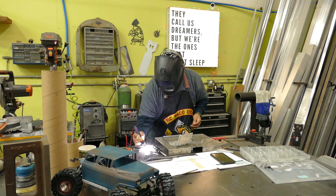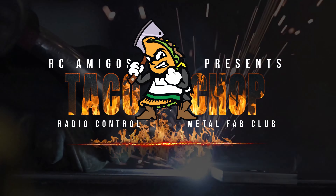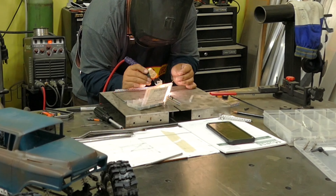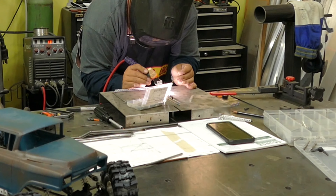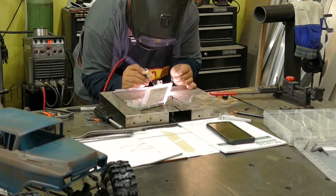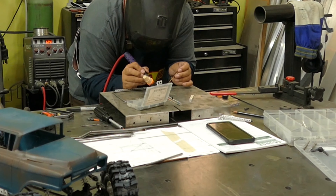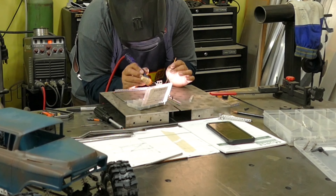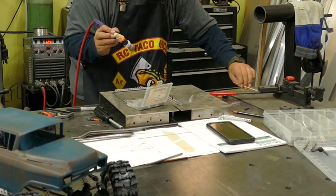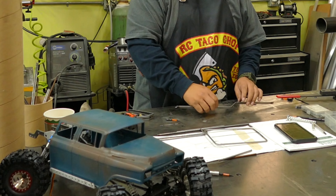Let's get some fabbing going. Today we're starting with the top hoop — I already pre-bent this at the end of the last video and just had to tack it. I took one piece and bent it into a rectangle. The machine is set at about 124 amps, but since I'm TIG brazing I'm barely getting up to 30 amps, staying really cool. It's a butt joint, so I don't want too much heat — I want the silicon bronze to bleed throughout the top and bottom. It was a pretty good joint.